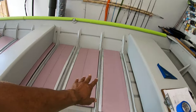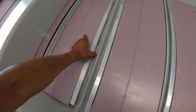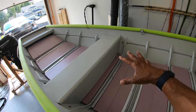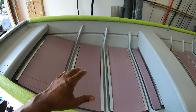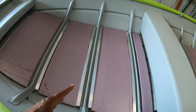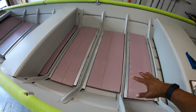One week later — I've got all the foam in for the main areas of the boat. What I'm loving right now is how well this thing is in here. All of these pieces are in; I'm literally pulling on it and it does not move — you can see where the adhesive oozed out. Of course, whatever framing I do will help hold everything down as well. This is a really cool way to create your own ribs on the boat when your ribs are very narrow, giving you a lot more surface using these one-inch aluminum square tubes.